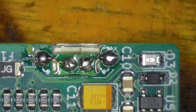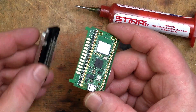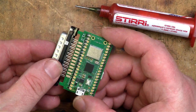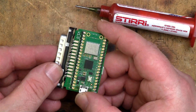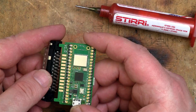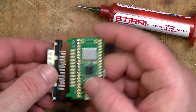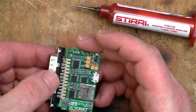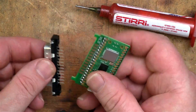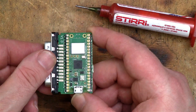We've got those two wired up to the USB port. The next thing I have to do is solder this board to the 25-pin connector. It's really cleverly designed — it slots right in between the pins of the connector. These little plastic tabs that stick out line up with the holes of the connector to make sure you get the position exactly right, and it's idiot-proof as well. If you put it in the wrong way, the pins don't line up, so that ensures you get it the right way first time. I'm just going to solder that on now.